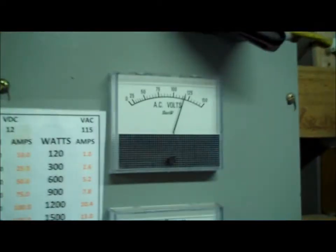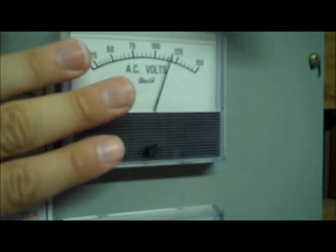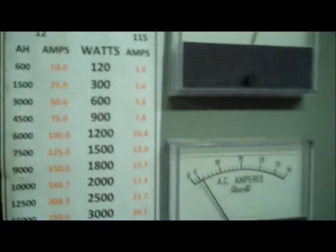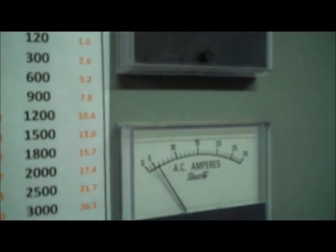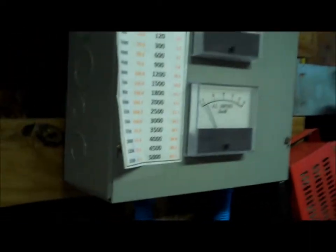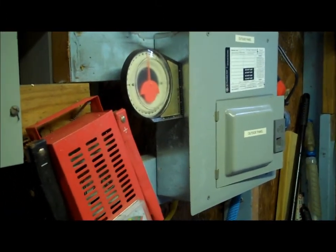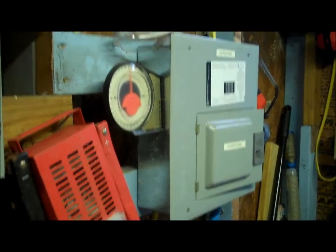We switch to solar panels again when it's around 13.5 volts and the battery system is charged — we're off grid. When we notice the water pump isn't getting water, or I look at the Current Cost system and it tells me voltage is low, I'll come out here and switch to electric. Right now we're at 120 volts, using about 5 amps — so there's some load inside the house. And I have another outside panel just for controlling the outside lights and things like that.